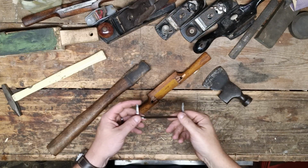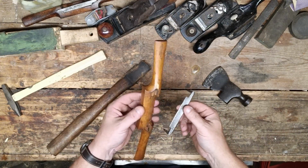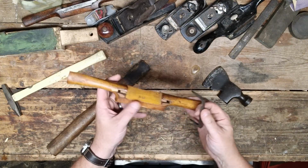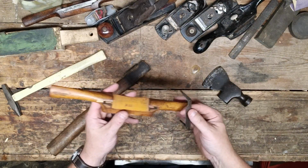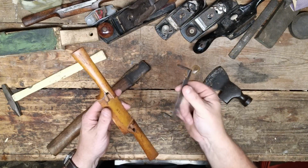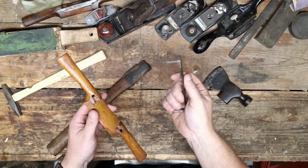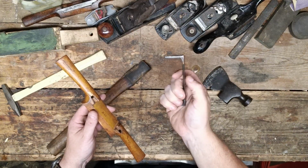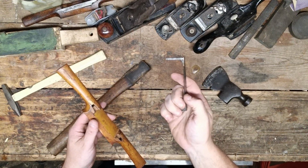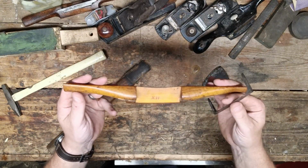It's Thursday night, and working tonight on getting this new spoke shave that I recently picked up tuned up. I've got the iron good and sharp now. Brought it out to a 1600 grit, and then hit it with the strop, and it is ready for some work. Picked this up locally off a buddy of mine.